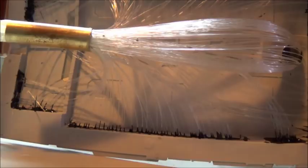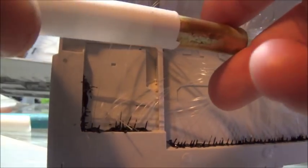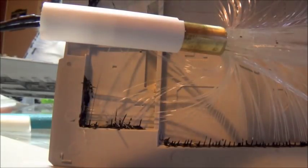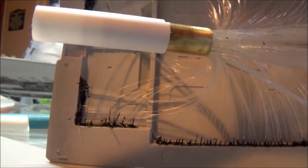But here's the deal. Put the tube over to act as a bridge. There you go. I take the 10 millimeter fiber optic, shove it in the hole. Now this is where everything's temporary because I'm going to glue all of this together, epoxy it all together. But that's in the hole, crammed up against the end of the fiber optic bundle. I'm running a 12 volt power source through said LED, and this is where things get a bit precarious now. See, look what happens. It fell out.